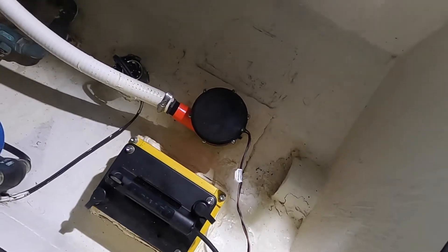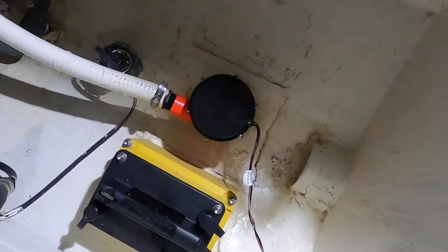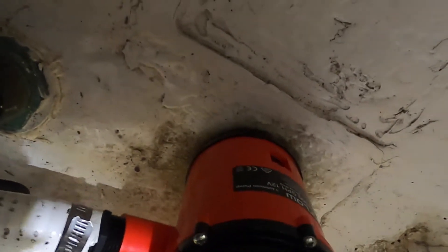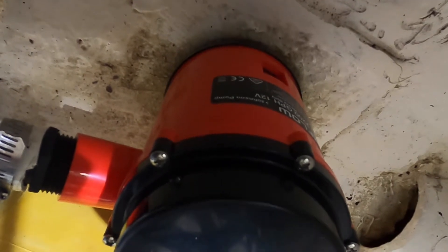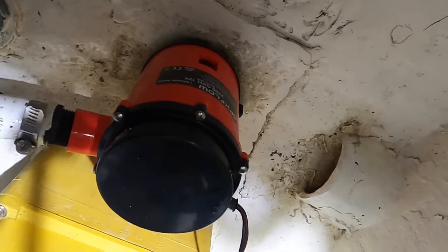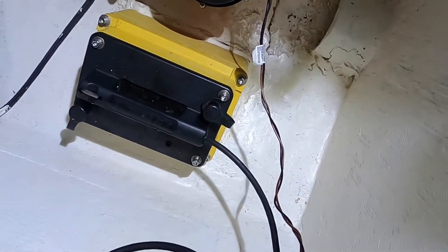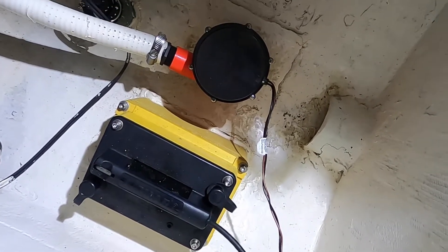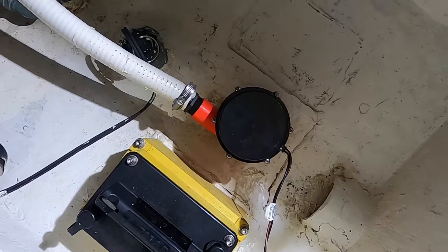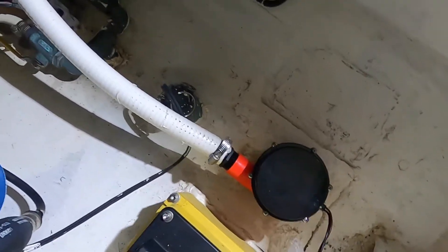The pumps are now in. The electrician was out here two days ago. We opted for Johnson pumps. The secondary pump down there is not on a float switch — it's just an emergency pump if we're getting overwhelmed. I call it the 'pucker pump' — if you're cycling this thing on from the helm switch, you've got trouble. Anyway, I opted to go from 1600 gallons per hour on this one to 2000 gallons per hour, since the hose size was still one and an eighth inch diameter, so there was no real change needed in the hose.